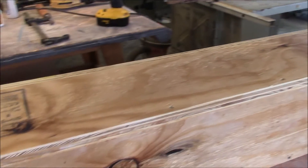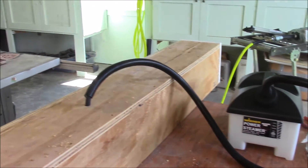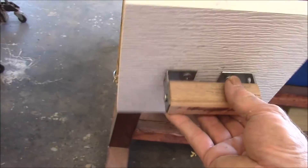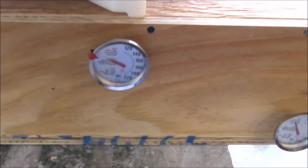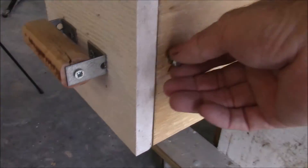Okay, here's the setup. We got our six-foot box. That little steam generator right there is a wallpaper steamer. It blows the steam in through the top, about the center. Down at the bottom we have our tricky little door. I got the wallpaper steamer plugged in — hose goes in the top right there. I installed a couple of thermostats. Over here on the door I installed a couple of little pins to hold the door in. Let's let this thing heat up and I'll come back when we get some temperature.